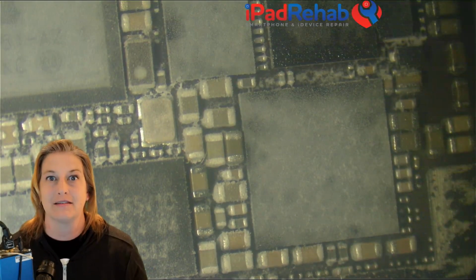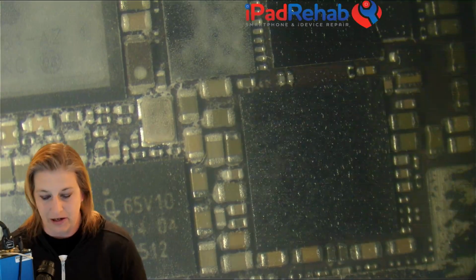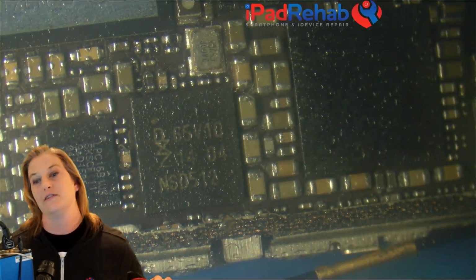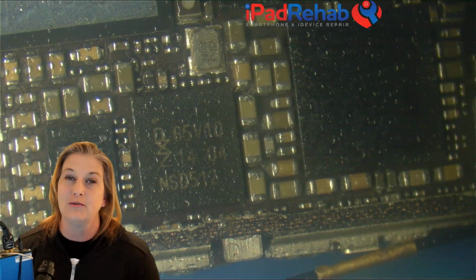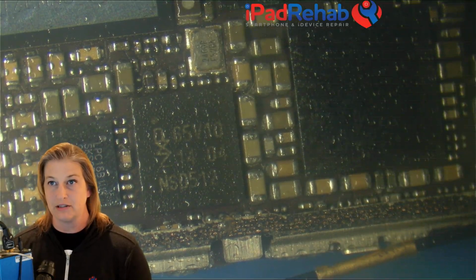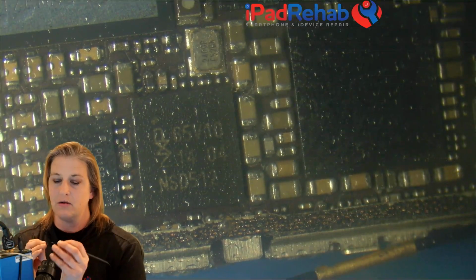Okay, next, let's find out what line is that? I have no idea. Let's look it up. All right, so let's get our multimeter out and let's just ask, are you short? And then we'll do some research. It's always good to know your line, because just because a dude gets hot doesn't mean that he's the cause of the short. We don't even know for sure that we have a short on this line. So let's find out. Let's go back to good old continuity mode and see.